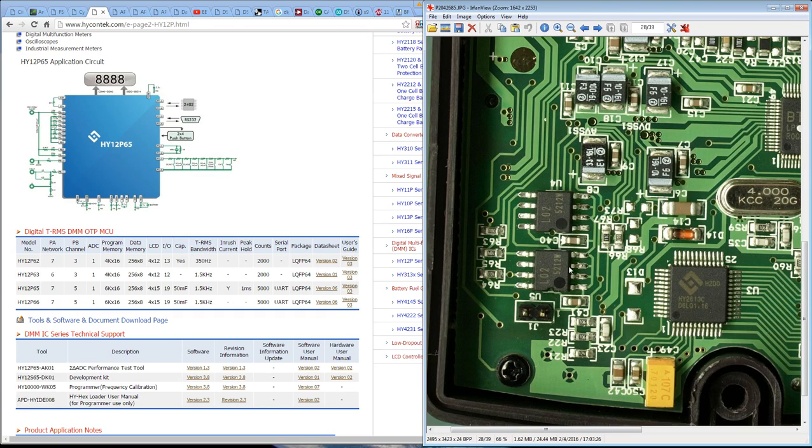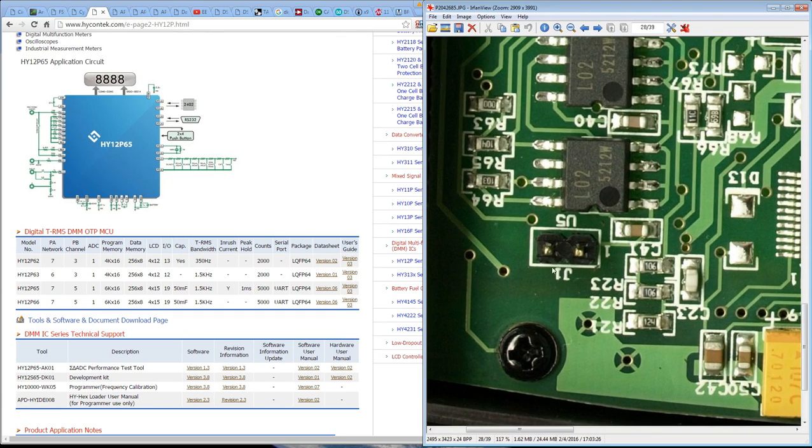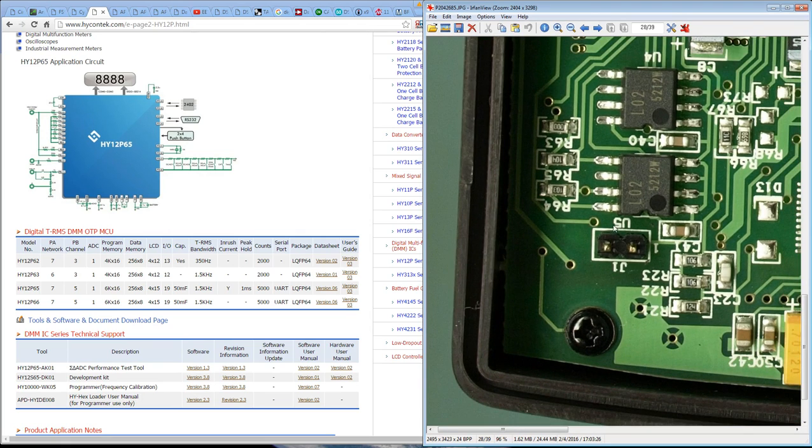Bummer. And if you're wondering what this puppy is down here, this little jumper link J1, my hunch was correct. I did actually check. This goes over to the write protect pin of this E² prom here. So this lower one, U5, is almost certainly the calibration E² prom. Maybe that's why they're using two. They're just separating the calibration.